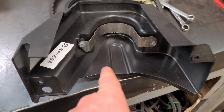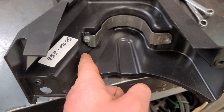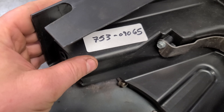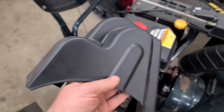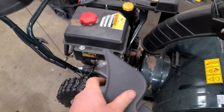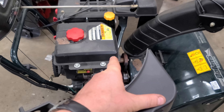The solution is to replace the belt cover with a new one. Here's the superseded belt cover — it's got a metal plate which protects the cover from wearing out like the old one. The part number is 7530-9065. Before you get a cover, double check which cover your machine takes, because some MTD machines take different covers and will have a different part number.